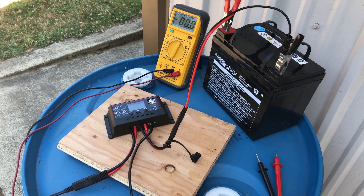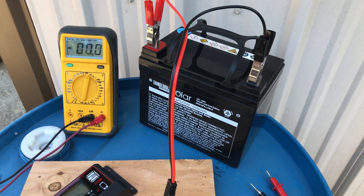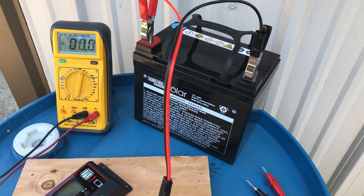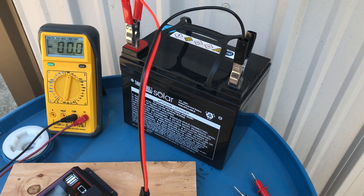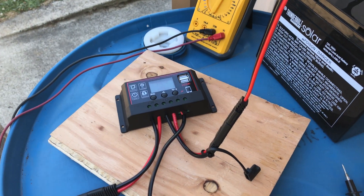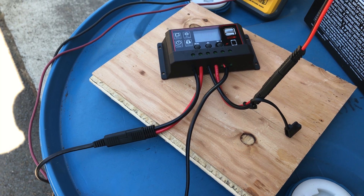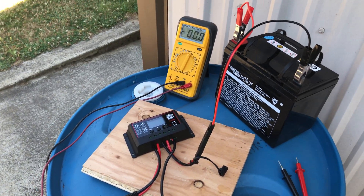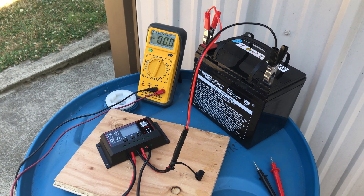I'm really happy with the system. I've got the solar battery here — just a regular 12 volt sealed lead acid battery, 35 amp-hour, from Harbor Freight — plugged in. We've got the Harbor Freight panel over there, a third-party charge controller, some Harbor Freight adapter cables which were quite affordable, and the system is up and running very well. Hope you give this a try yourself. Thanks for watching.